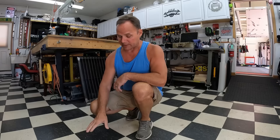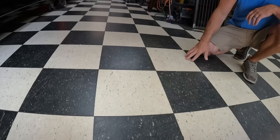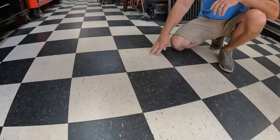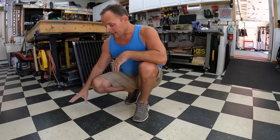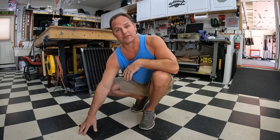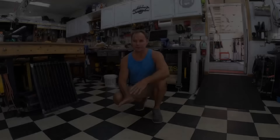Would I put this in a garage floor where I'm parking vehicles? No. One thing you notice - especially on white or any light-colored tile - is if you pull a vehicle in on it, it will leave black tread marks that kind of stain into the tile. You obviously wouldn't see it as bad in the black tiles, but you do see it in the white. I've seen car showrooms and motorcycle showrooms where they have these tiles, and when they pull a vehicle away, you can see the tire staining. Most places put a mat or rug under where vehicles park.